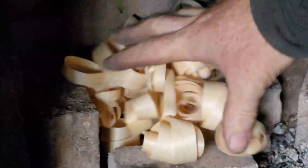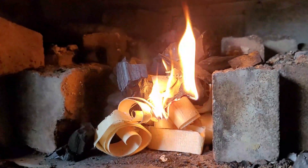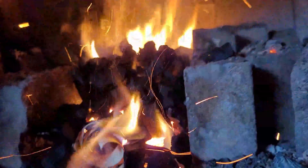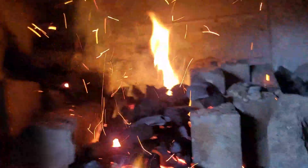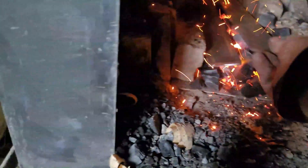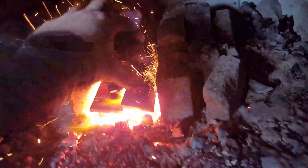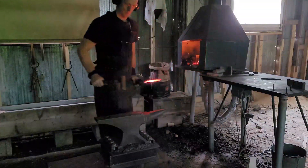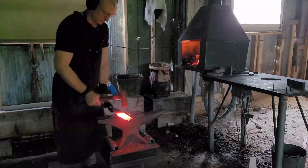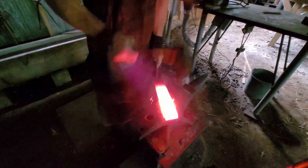I find lighting with wood chips just a little bit more fun. The steel I'm using is already annealed, so I just need to bring it up to temperature and I can get right to work. For the actual bars that will be forged, the plates just need to be textured. I bring that quarter inch down probably closer to three sixteenths in the center and then out to a sixteenth on the long edge and the short edge. This is just the texturing — pushing the impurities out.